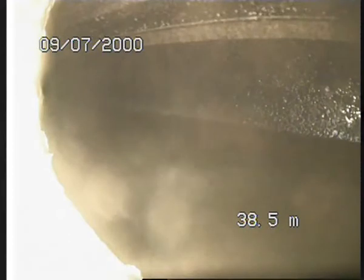Regarding the sewer drains, there's definitely issues, multiple issues with it. You've got a few displacements, minors, some between medium and small. You've got a pipe that is cracked, which I'll mark as well for you. You've got a small dip in the line, it's holding water or flat. And you've got quite a bit of incrustation coming in. And at one stage on the inspection point, you've got water dripping in as well.